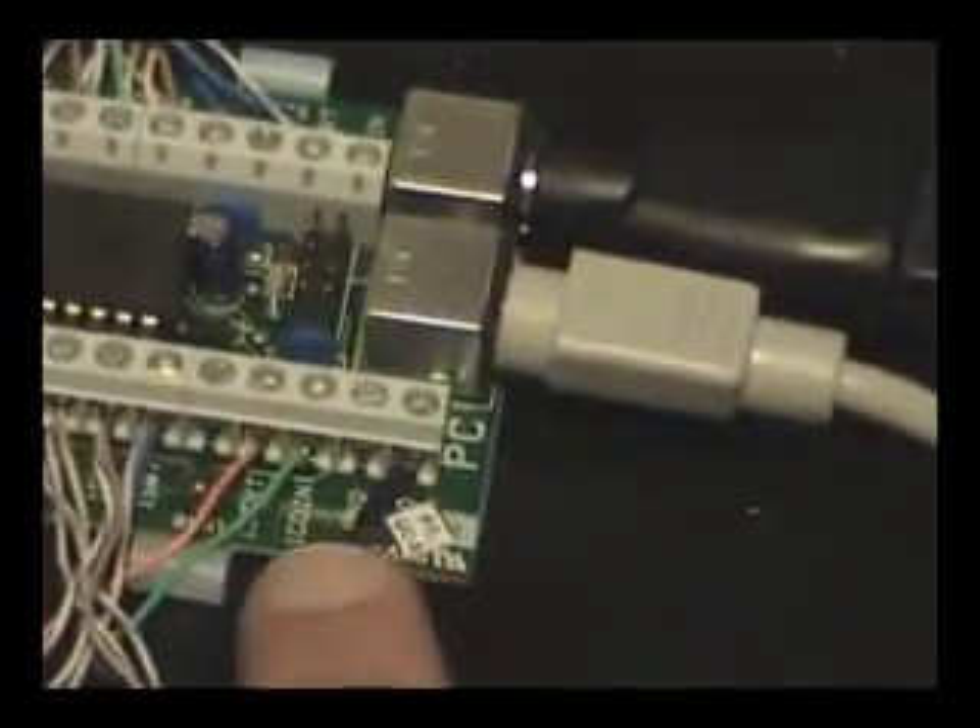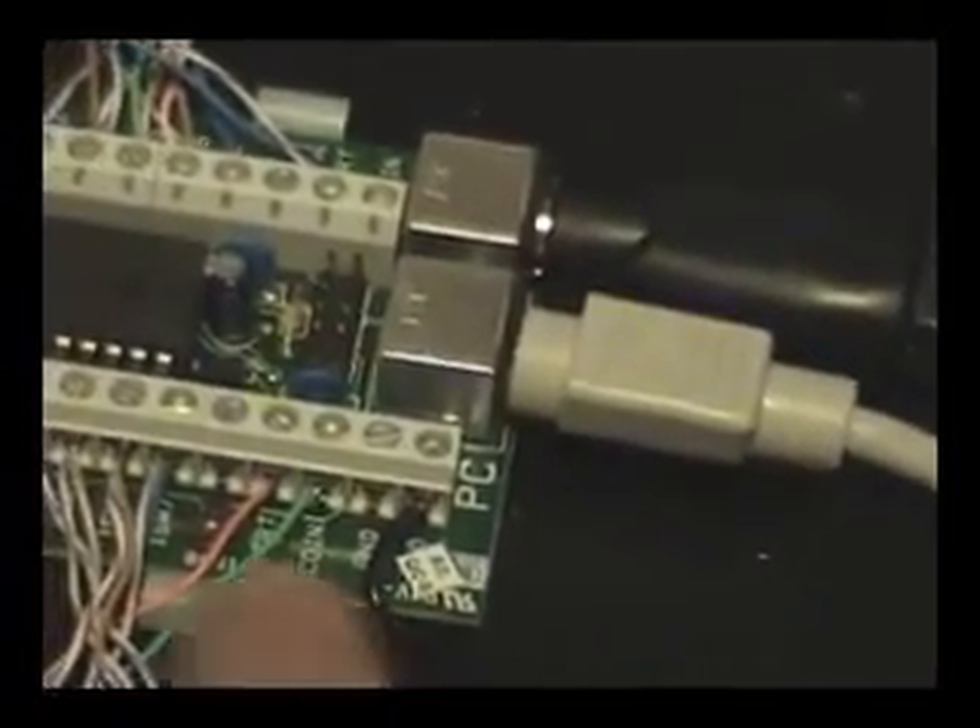The first thing you want to do is wire up the ground. The ground is this one on the outside — you can actually see it better there. You want to daisy-chain them all together. You can put hundreds of wires going straight to the ground point on the board, which is clearly labeled 'ground.' Then there's player one coin and so on, all the way up. Player three is here, player four is on the other side, and player two is over there.